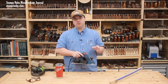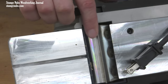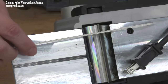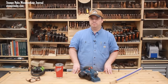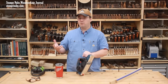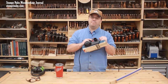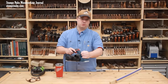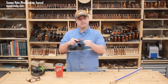It's important also to be sure that your blades are properly set. Don't assume they are — check them from time to time. The adjustment process is different from one model to the next, so I recommend consulting your manual for information about that. Now operating an electric planer isn't difficult or particularly dangerous if you know what you're doing. Just remember, this isn't a belt sander. It's not meant to scrub back and forth or swirl in circles. It's meant to shave wood one forward pass at a time.